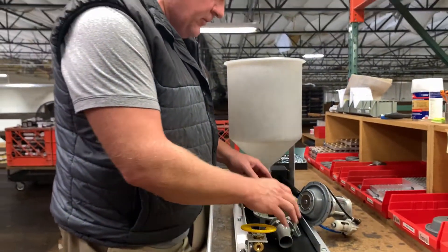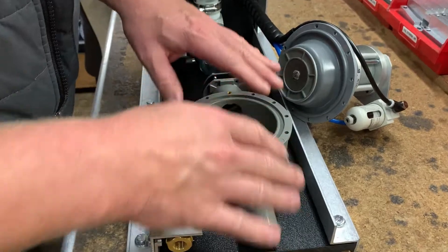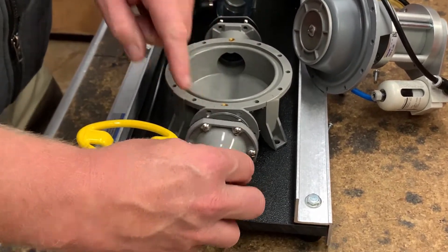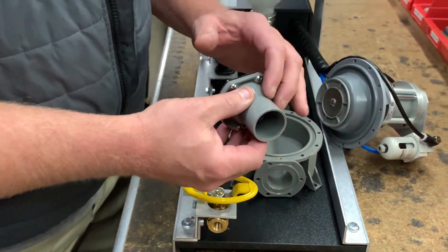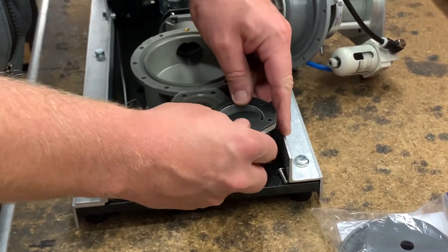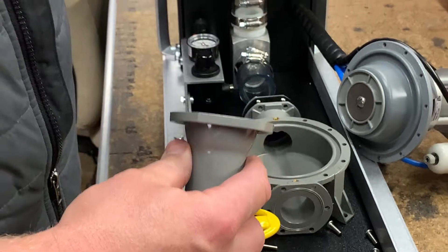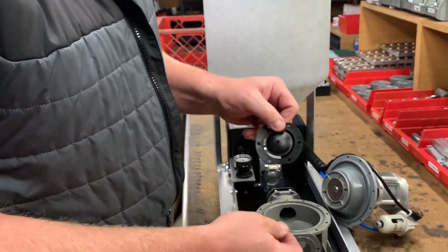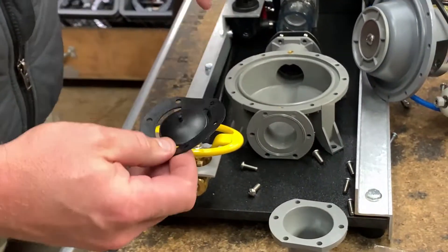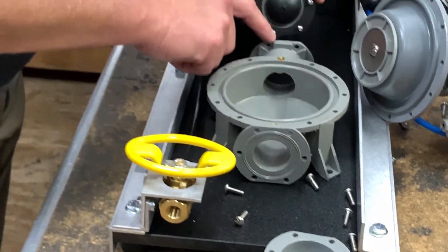We're now at the point of changing the flapper valves. The pump body's already pulled off and disconnected from the baseboard and hose. Unscrew all six screws on both sides — you have your outlet and your inlet. The outlet is going to have a longer neck than the inlet, so you can't get confused. Knock your screws out and push them through. On the outlet flange, notice the way the flapper valve sits — the bowl with the little tip was facing on the inside. A lot of people make the mistake of putting it in wrong, which causes the pump not to work.